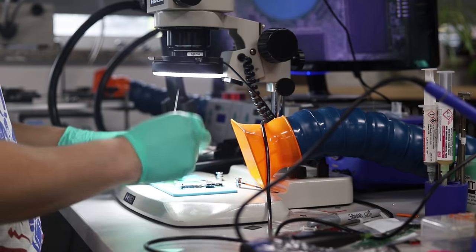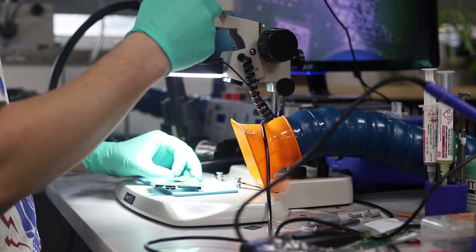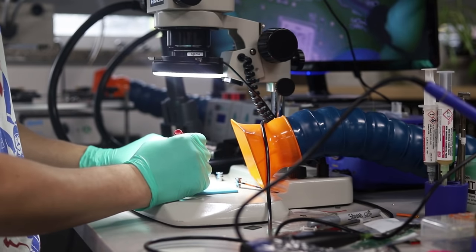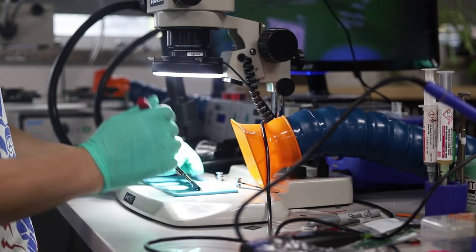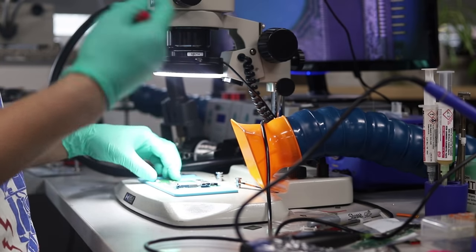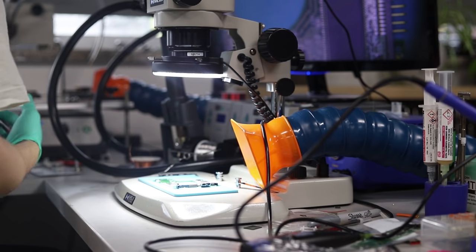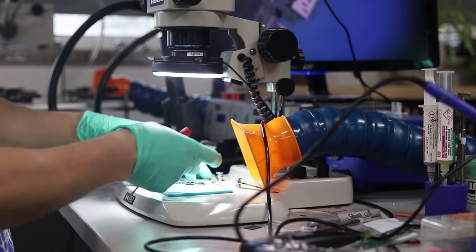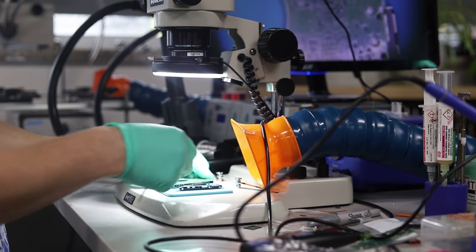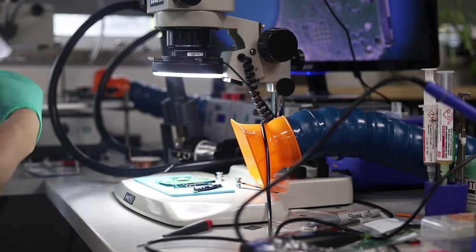So this is what the board looks like. And adaptation can be done in several ways. Now, this drive has 771801 part number here in the middle. If you get a 771823 board, that would be already prepared SATA version of this device. I have these boards here somewhere, but today's video I want to make it a bit more interesting by actually showing how this conversion can be done manually. Aside from the connector part itself, you're gonna need to have this diagram,